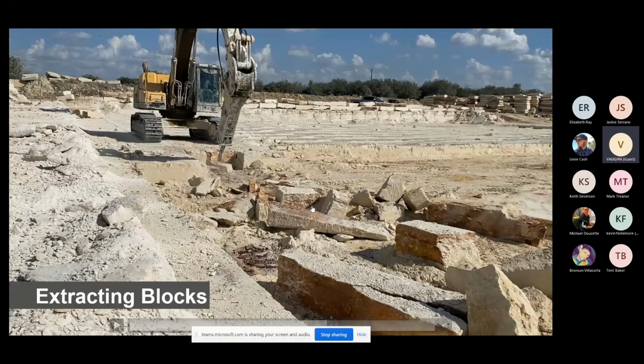But one of the reasons he's removing all these little pieces is that if that loader comes in and one of these pieces hits the side of his tire and pops it, you have to replace all 4 tires, not one, which is an investment of over $24,000. So he has to be removing area for that loader to come in without having to run over these rocks, and causing major expenses.